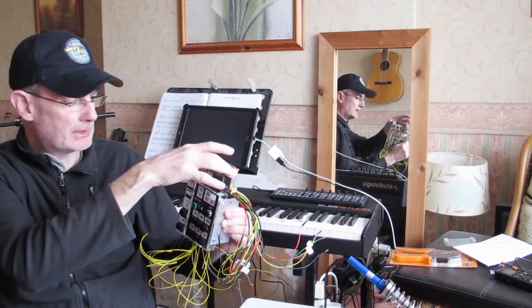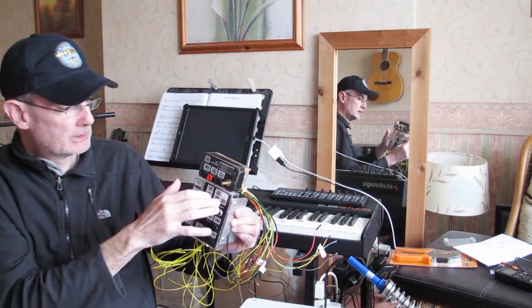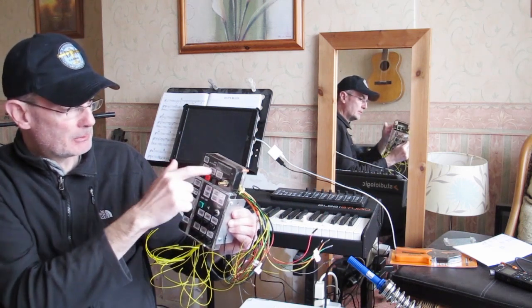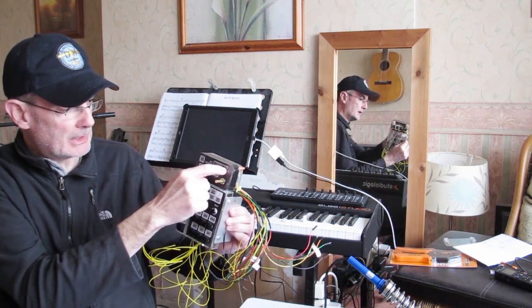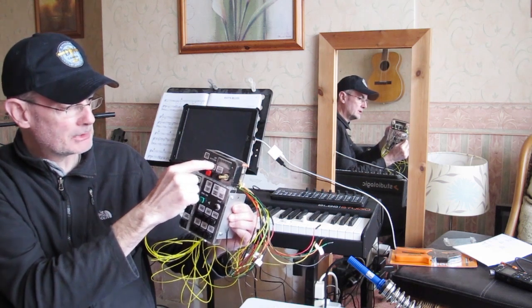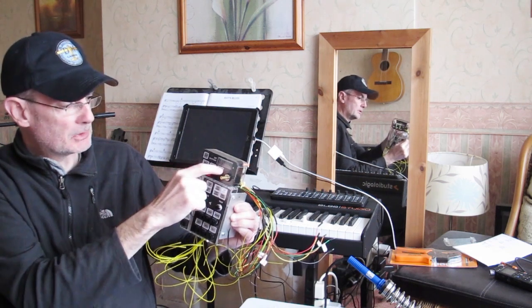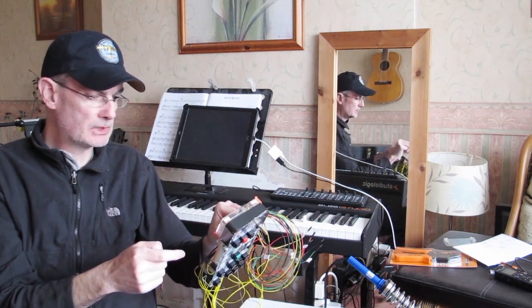You can see I've now got the altitude alerter mounted on top of the new panel — that's looking pretty good. I've also tidied it up: I went in and took out the tracing paper behind the digital display, and I've put a couple of little partitions in to try and prevent too much bleed between those LEDs. We'll see how that goes.